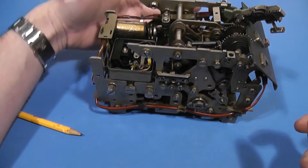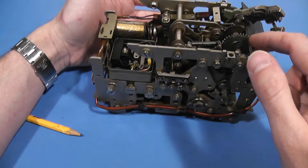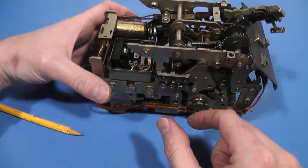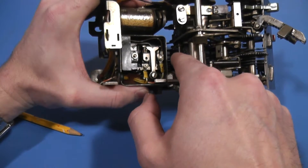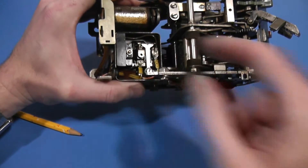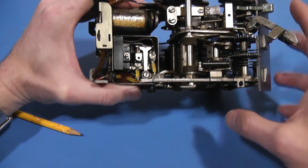So that's how the LXD works — that's how it reads the tape. The shaft rotates and once tripped it senses each of the pins in a row with a cam on the bottom of the unit. As it senses those pins it allows the transfer bail to tilt one direction or the other, which moves the switch in the signal generator to either the mark or the space position.